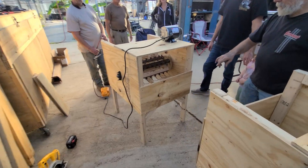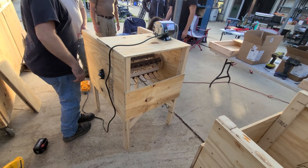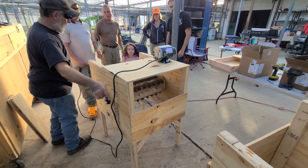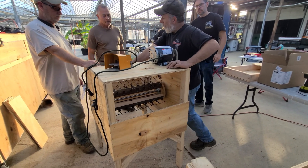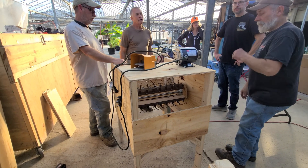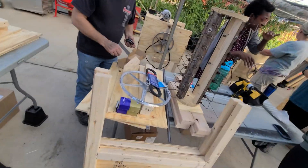You'll pull your vine through this way; you'll pull the leaves off, or the ones that come off. Vine comes through this way, you feed it this way, the shaft rotates that way, and it throws all your product off the back. The cool part about these fingers is there's really nothing on them that will catch it, and it spins fast enough that it's kind of levitating the product anyway. The flywheel smooths out your cycles because it stabilizes everything.